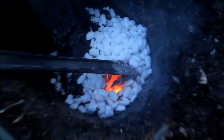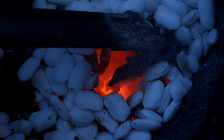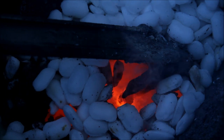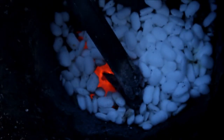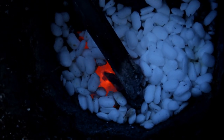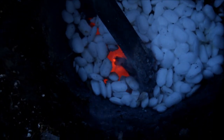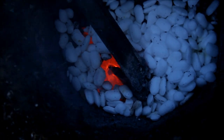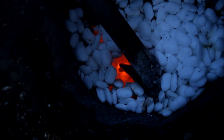How's it a volcano? Well, because there's lava. Right now I'm melting a bunch of rock salt, but eventually I can put in limestone and get it hotter and hotter. I started out by simply drawing an arc, and arcs are naturally hot enough to melt salt. Once the salt becomes molten, it can become hotter and hotter, and it's a kind of exponential feedback thing. As more salt melts, the more current I can draw through it to melt more salt.